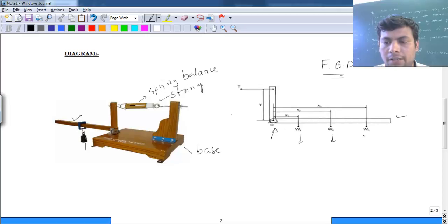One weight is added here, another weight at a different distance — we can have any number of weights at any distance. Generally we go for two or three weights at different distances. This vertical distance is fixed and is called y. For our experiment setup, we take y as 20 centimeters. Another force is the tension force due to this linkage.